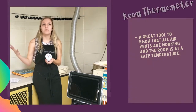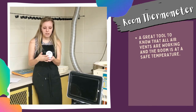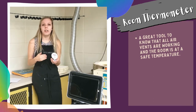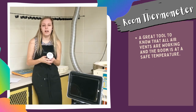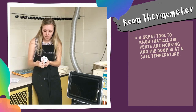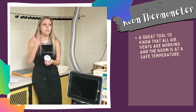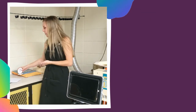Another thing I'd like to share is having a temperature gauge for the room around your kiln. Even though I have a good air ventilation system that I turn on as soon as I leave the building — since by that point the kiln is getting hot enough that you can feel it — my kiln is in my classroom and the vents can vibrate and be rather loud. A room temperature gauge will tell you the temperature around your kiln, which is really helpful for knowing if the air filters and ductwork are doing their job.